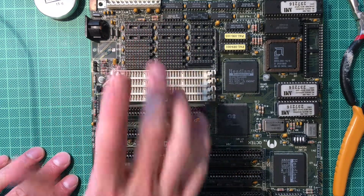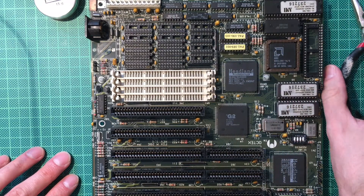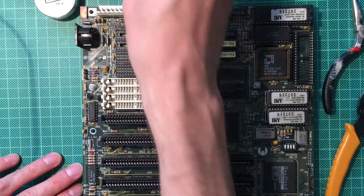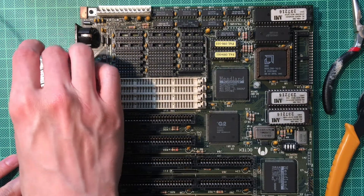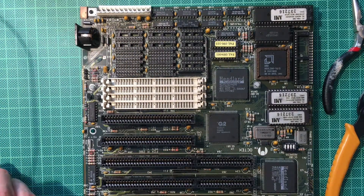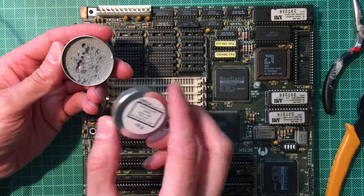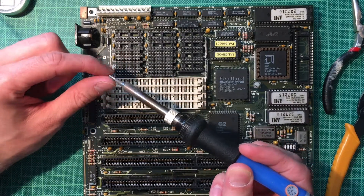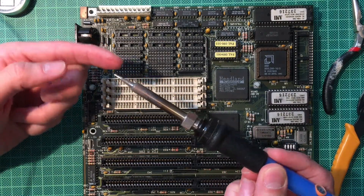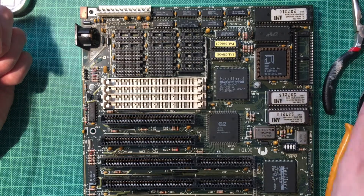This will be a bit tough — I'll be using the snips a lot, and some tool to pull everything out, probably a lot of solder wick and some flux to help the solder flow better. I also bought some tip reactivator for my soldering iron — it's basically tin and copper mixed with flux. You put the iron tip into it to keep it shiny. You should do that every once in a while when you see that your soldering iron's tip gets dirty.